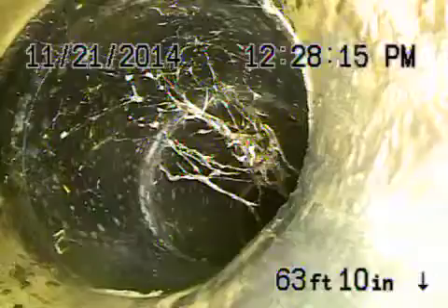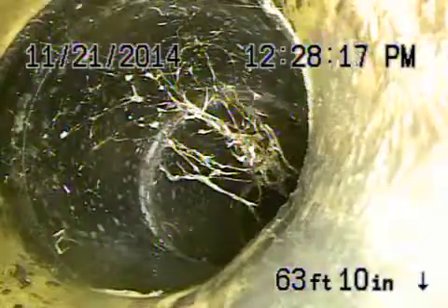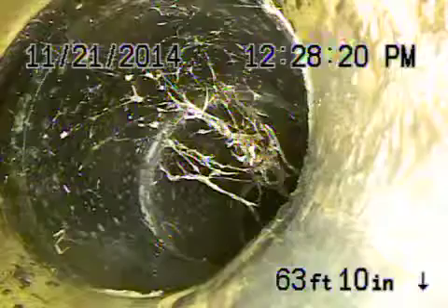They did shoot a fiberglass lining upstream. You can see there are very minor roots coming in through the band here. Pull it back a little bit and that's right by that retaining wall.